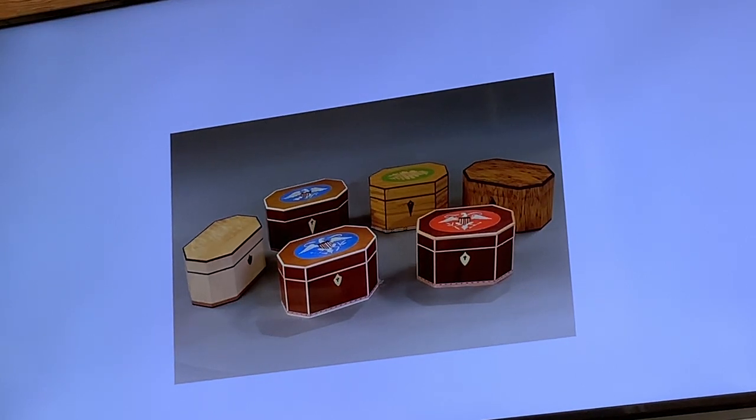Made these last Christmas for Christmas presents. They're octagonal tea boxes, tea chests. You can make those with a little set of cutters. They make router bit cutters that will cut angles, like for flower pots, and you can buy a cutter that'll make an octagonal cut. Once you get your router table set up, just run those things through there. Cut the sides, and they fit together with a spline miter or a clamp on them. You can make them in no time.